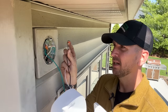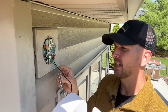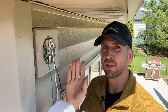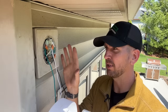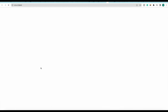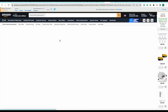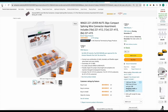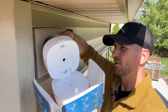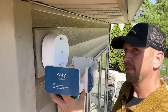Now one connection is made and I'm ready for the hot wire. With the lever already up, I connect my hot wire, close that lever, and then do the same thing for neutral. Literally that fast — secure connections all the way around. There's just no comparison: Wago lever nuts really shine in this type of application and I highly recommend them. If you need a quick reference on where to get Wago lever nuts, look below the video for a link to our Amazon store — scroll down to the electrical section and get one of the inexpensive kits that includes two-wire, three-wire, and five-wire Wago lever nuts. With pancake boxes you don't have a ton of room, but you do need to try to get those wires all contained within the box itself.